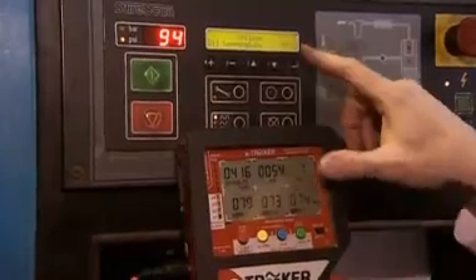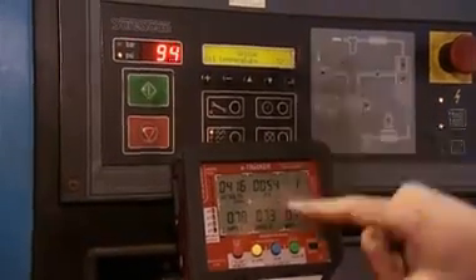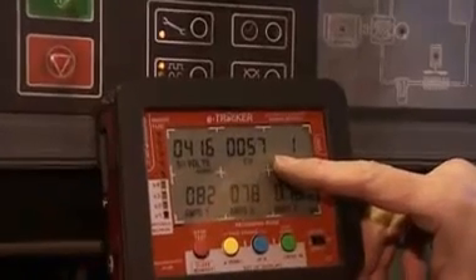As the pressure drops, it's going to come on-load, and as it comes on-load, the compressor on-load is taking 57 kilowatts. It's working for about two-thirds of the time — 20 seconds on-load, 10 seconds off-load.